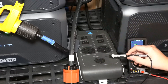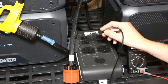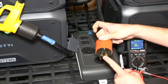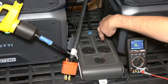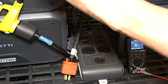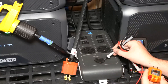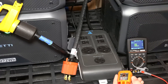This L14 has a direct connection on the master side, which is why when I plug in my transfer switch, anything happening on the grounding system for my transfer switch leads down through my L14 and goes up the master side. That's why on my master outlet tester I'm seeing that slight voltage. But obviously this ground is not going up the slave side, and that's why I don't see it there.